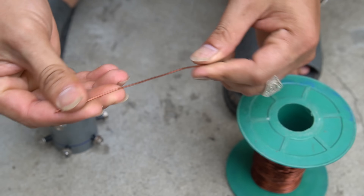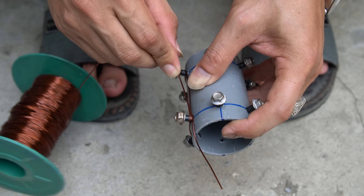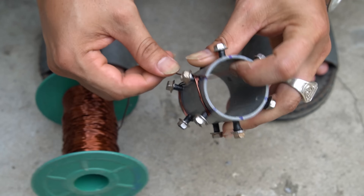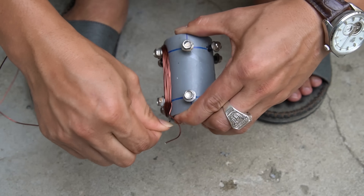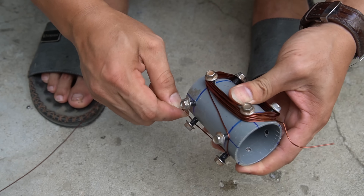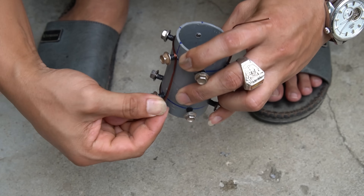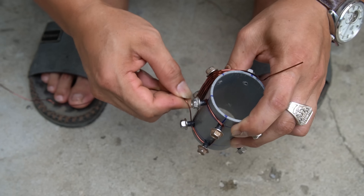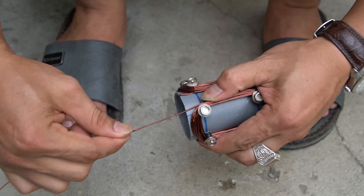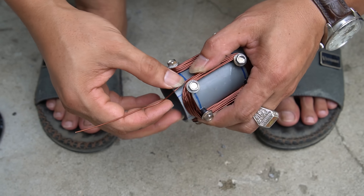Next I used 1 millimeter diameter copper wire. I will wrap the copper wire around the screw head in a rectangular shape. Take it slow and be careful because just one small mistake can make us fail. After finishing one round I will wrap the next round — each round wrapped 50 times. Once all the turns are finished I will cut off the excess copper wire.